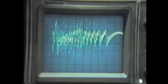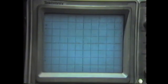It's a very short duration spike, and in fact it's so fast that sometimes the scope cannot pick it up. It just refuses to trigger here until we set it again. But this is what's in that spike. I'm getting the best picture that I can of it because the scope refuses to do any triggering at all. And this all amounts to about a little bit less than about 12 volts.